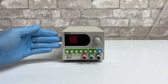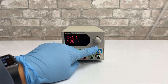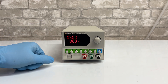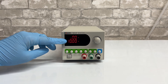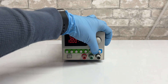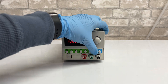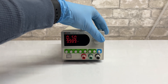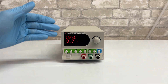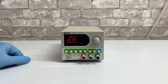A nice safety feature of this power supply is that it can be run voltage-driven or amperage-driven. If voltage-driven, you set a specific voltage — say 5 volts — with amps as high as 10 amps, and the supply will not exceed 5 volts. For amperage-driven, say you're plating with gold and don't want to exceed 2.5 volts — you can set the amperage to 0.625 amps, and when plating it will cap at 0.625 amps while the voltage adjusts to whatever it needs to be.